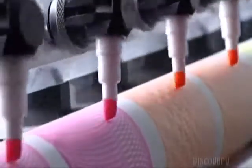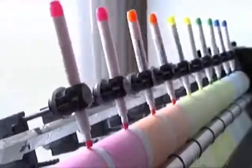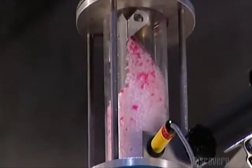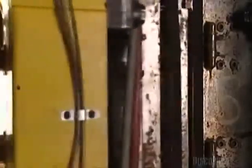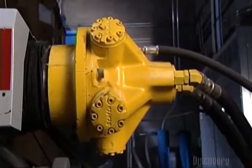When it comes to highlighter pens, drab colors are a write-off. This is how a highlighter pen gets its start: a vacuum siphons plastic pellets into a container. The red ones will tint the whole mix as it melts inside a heating tube. A mechanized steel screw pushes the melted plastic into pen molds. The force applied is equal to the weight of 350 elephants. Cooled by water, the newly molded pen barrels spill into a container below.